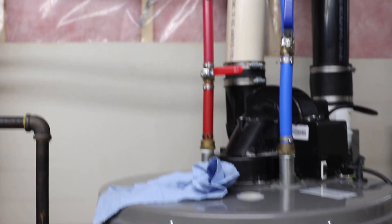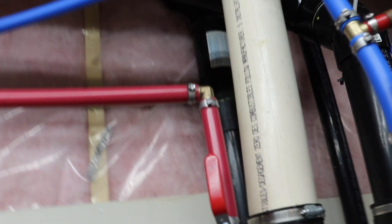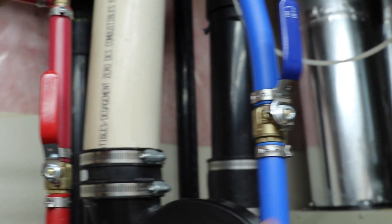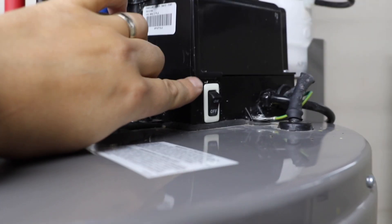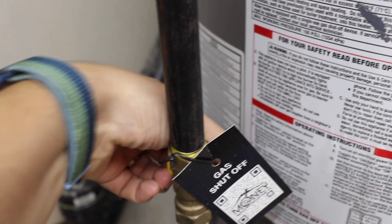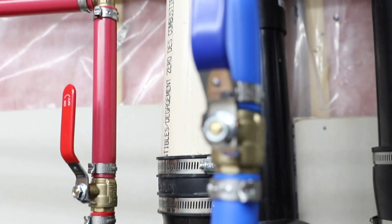What we can do is simply open the hot water valve as well. I turned on the hot water faucet and noticed the water was running smoothly. That basically tells me the water is able to go into the tank and is high enough to flow out. The unit is plugged in but still turned off. Now I'm going to turn on the gas line and the gas flow. The fan is working and I did hear a little click from the gas ignition. No water anywhere - I double checked. No leaks anywhere.